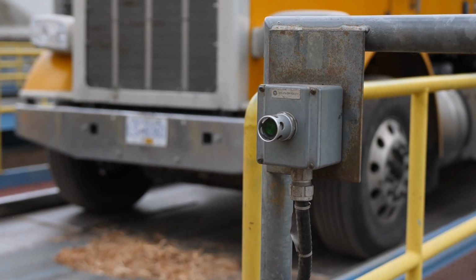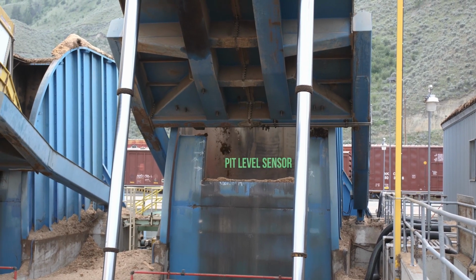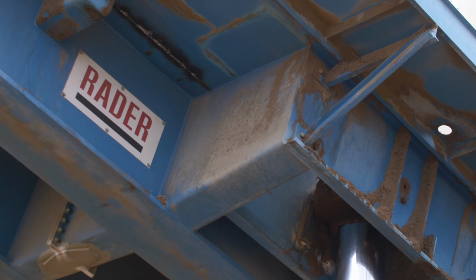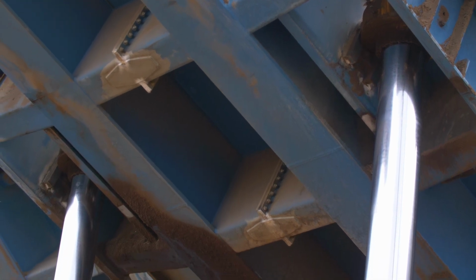In addition to the activation buttons, sensors have been added inside the dumper pits to ensure that they are not overfilled. If the hog levels in the dumpers block the sensors, you will not be able to raise the platforms. You should be aware that the dumper will not activate if the dumper pits or if the conveyor system in the hogger building have been plugged with product.